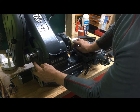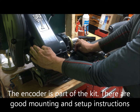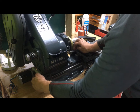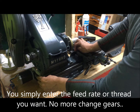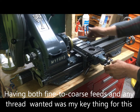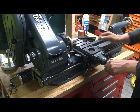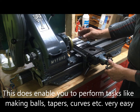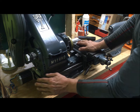I'm going to mount an encoder here from the spindle so it can read the speed from the spindle, and then the controller will output the correct amount of feed — or, for threading. The main thing about this is the ability to replace the gear train; that was the main thing for me. The cross axis I'm not sure I really need, but I bought that too, as it enables you to make different kinds of shapes automatically.